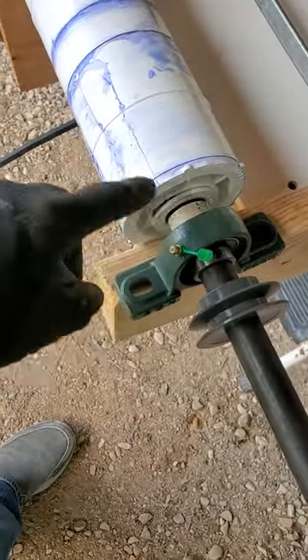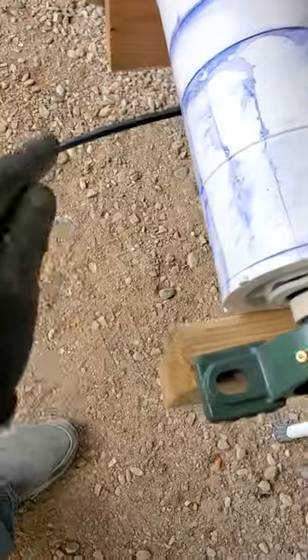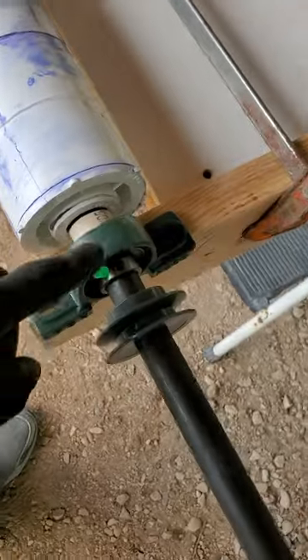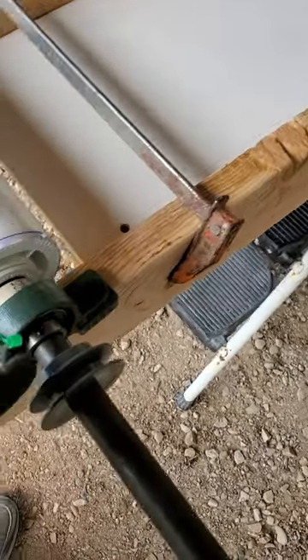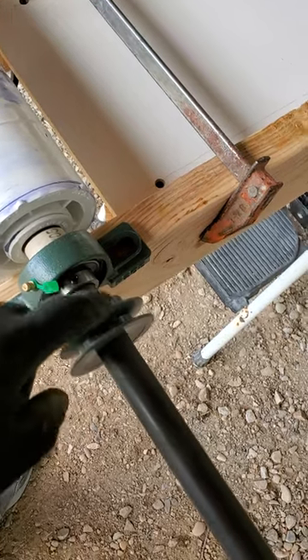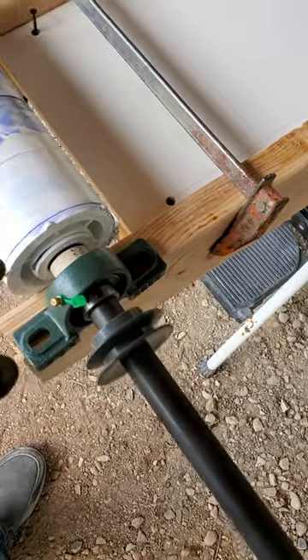This apparatus is going to sit on this face so the belt comes out and around and under. These are one-inch pillow block bearings, available on Amazon — they're kind of cool because they come with little set screws so this shaft is going to be captive. You don't need anything to stop it from moving; it will be locked in place. So that is as far as I've got — I will keep you all updated.